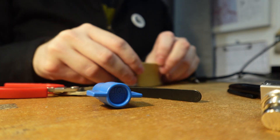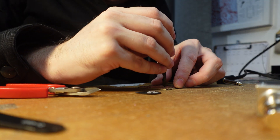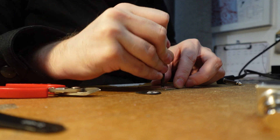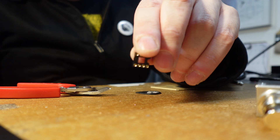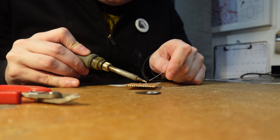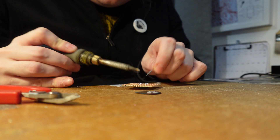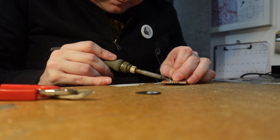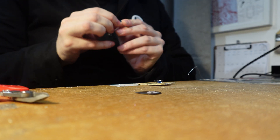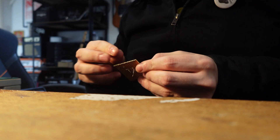So I'll put this together on Vero board. I probably will do some sort of PCB in the future. It's a bit awkward at the minute because I'm not sure, with US tariffs at least, how they affect small shipments like little PCBs. But yeah, Vero for now. I'm literally just making this up as I go along. I tend to just start with the op-amp and then mark out where the ground is going to be with a sharpie, just so it's visually obvious, and just start poking resistors in.